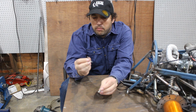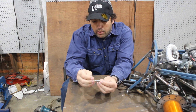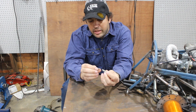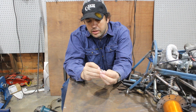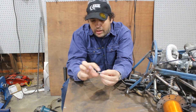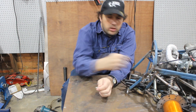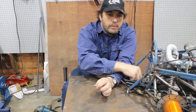I've got my little tiny piece of Bundy tube with a bend in it, and I've got the other piece of pipe that's meant to attach. It's got a fair gap around it, so I'm just going to shrink this down, put a taper on the end to fit snug over that, and then I can just TIG them up.